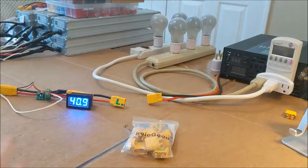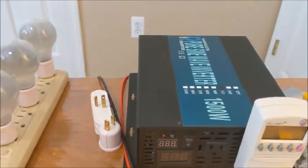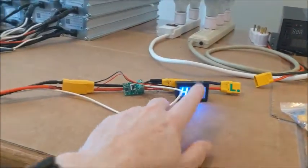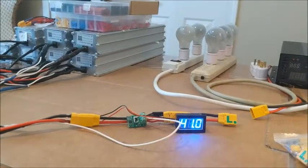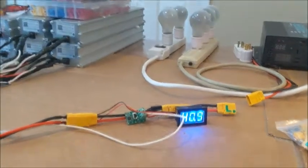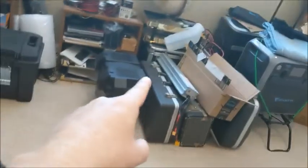Alright, this is going to be the spark arrestor hookup. Let's see if this thing is going to work. I had quite a few people engage me on the capacitors in this 1500 watt inverter. When you hook it up to your main power source and batteries, you get that large spark, and that large spark could ultimately damage things. I think that may have led to damaging one of the BMS's in one of my faulty batteries.